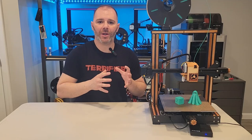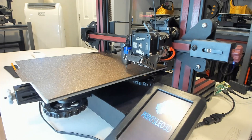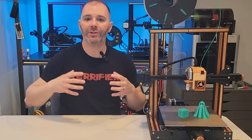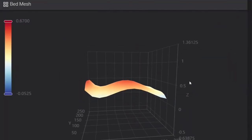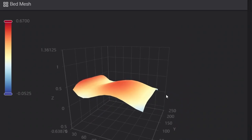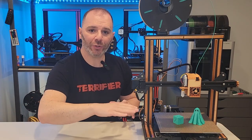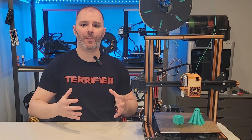What is a mesh? If we were to have a BL touch auto bed leveling device, what it does is take measurements of our bed at various locations and turn those measurements into a virtual topography of our bed — known as a mesh. That virtual topography represents the actual dips and contours of our bed. While our 3D printer is printing, that mesh is used so the nozzle adjusts to the contours of the actual bed, helping us print a completely flat first layer.